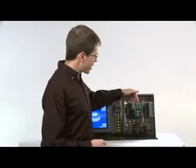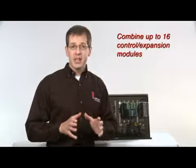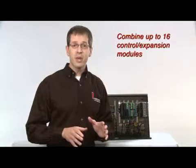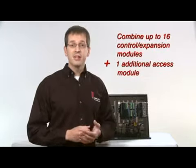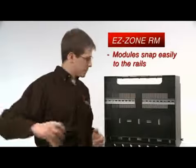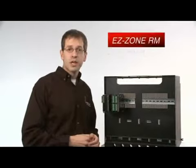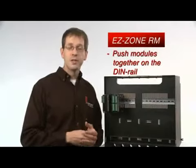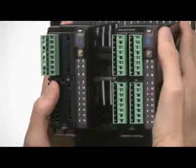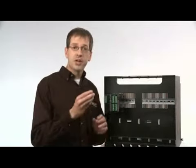There are three modules in the Easy Zone RM family: the control module, an expansion module, and an access module. You can combine up to 16 control and/or expansion modules in any configuration, plus one optional access module which gives you communications and data logging capability, making 17 modules total. To mount the modules, simply snap them to the DIN rail. Internal connectors allow modules to communicate at a system level by simply pushing them together on the DIN rail with no additional wiring needed. These modules are scalable from one to four loops — it's as simple as adding a connector to add an additional loop.